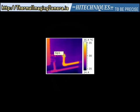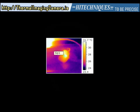Repeat this procedure every time you select a new target. If you want to detect cold spots, air leakages and so on, point the crosshair at the coldest spot. This appears dark blue when using the iron and rainbow palette, and dark grey when using the grey palette.